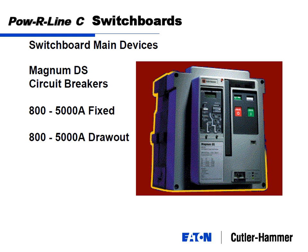And why would that be beneficial? If you like to do maintenance, you can do maintenance every year, pull a breaker in and out of there very quickly. If you want to shorten downtime, if downtime is critical, and you ever did need to replace a breaker, the breaker could be removed in and out fairly quickly and limit your downtime.